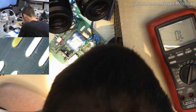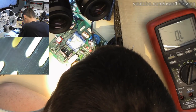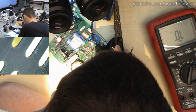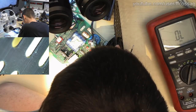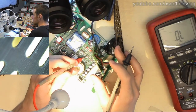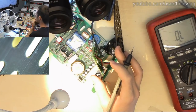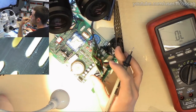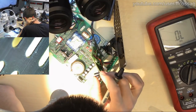It's probably going to the comparators and the power on reset things. I would wager those are. That might be the power on reset output. The transistor is going to this IC, which is a power on reset IC. A 330 ohm output impedance on that is absolutely fine. And we don't know what that pin is supposed to be.